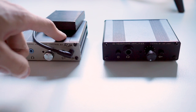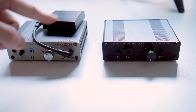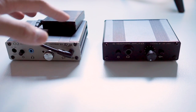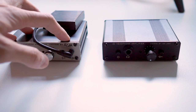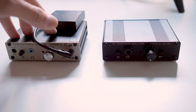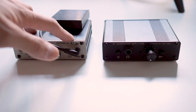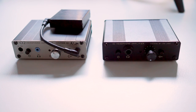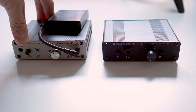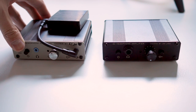You can clip the resistors on the Objective 2 to change the 6.5x gain setting to a 1x gain setting, so you can choose between 1x and 2.5x gain — or you can request JDS Labs do this before they ship it. 1x gain means no amplification, but you still get the benefits of the Objective 2's low noise output, low output impedance, and all its high-performance characteristics. Technically 1x gain is also the highest performance setting. I use it almost all the time because most of my gear is low impedance, and even the Sennheiser HD 650 is perfectly happy at 1x gain.